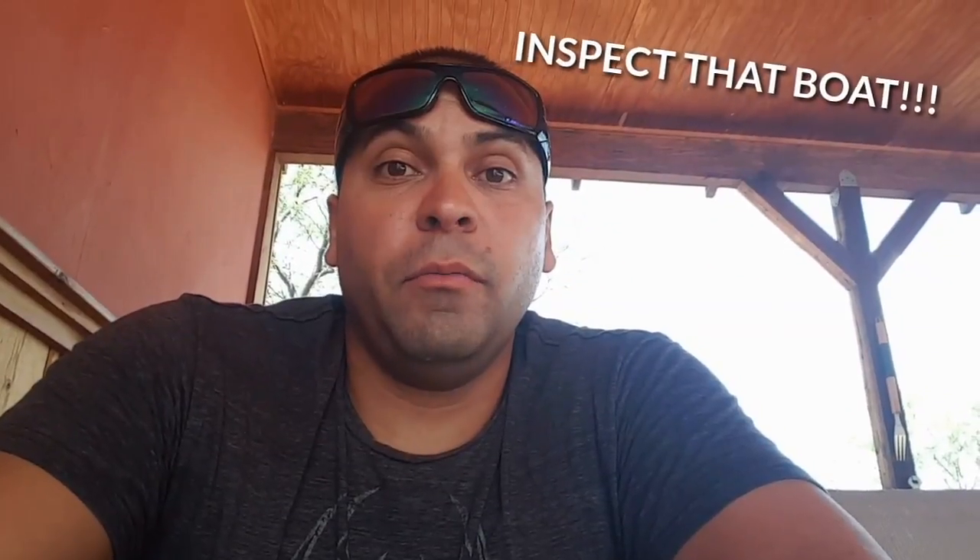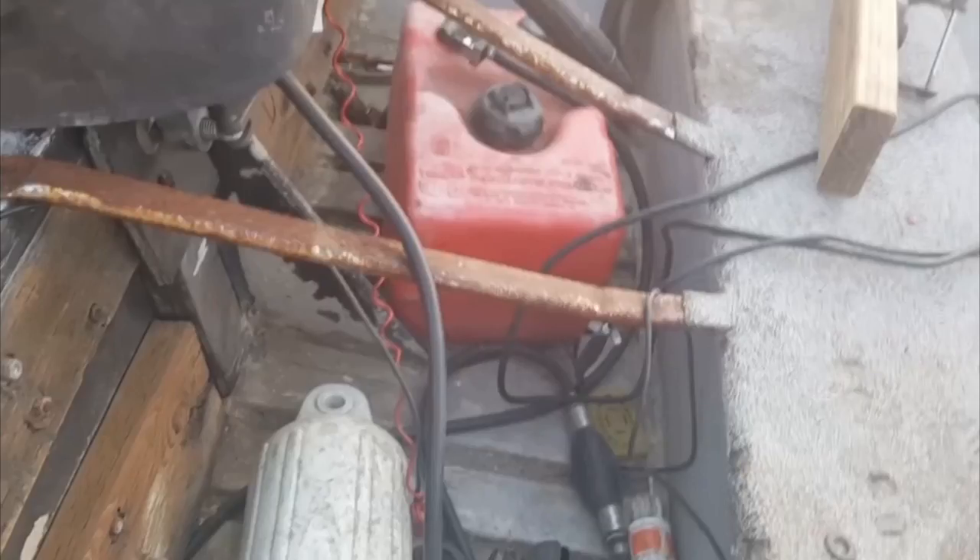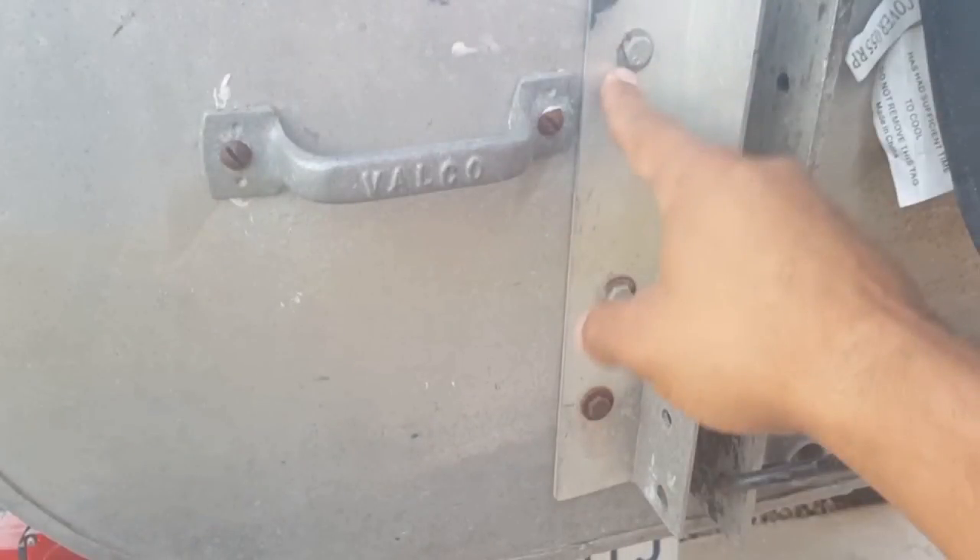Final checklist: if you're going to buy a used boat off the owner, he's not going to tell you about the bootleg crap he did to it. Look for bootleg mods — look for a bunch of holes all over the boat, that's just not a good thing. Look for weird stuff, look for stuff that's rusting: if it's got a lot of bolts, beams, or anything that's rusting, steer clear. If you find a bootleg transom-saving mod like poles bolted from the transom to the bench seat, that's not good — it means the transom was flexing.